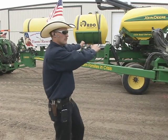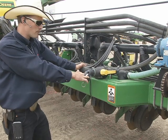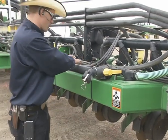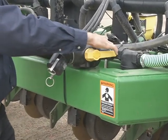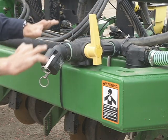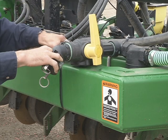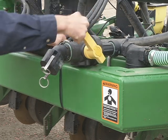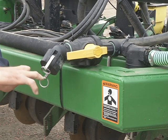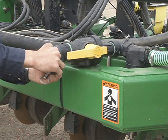Starting with the tanks, moving over to the left wing — this is the fill port. You take this cap off. This valve here, you'll notice how it's pointing is the direction of flow. So if I take the valve like this, the valve is shut — fluid cannot flow here, here, or here; it's completely shut. If I take the valve and go like this, now fluid is going to flow ideally from the pump that the farmer has, with a quick connection coupler connected onto here.